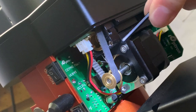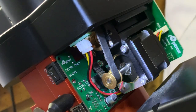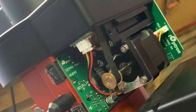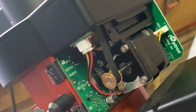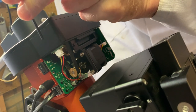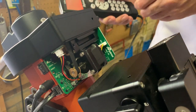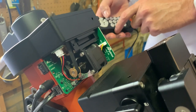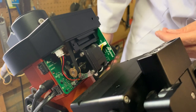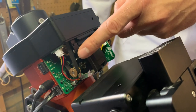If you can see here, this belt has a little bit of wear to it. Let's see where this area on the belt is when slewing. It seems to be that the damaged part of the belt is inside the housing every time it makes this popping sound. Perhaps if we go to max slewing mode it makes it even clearer — it's every time that marking is on top.